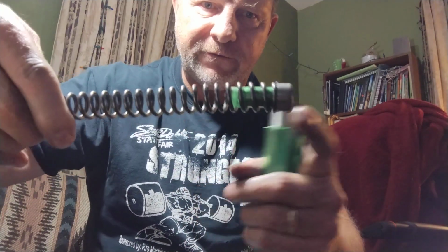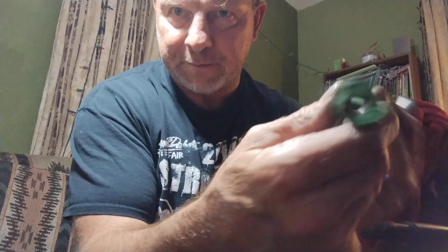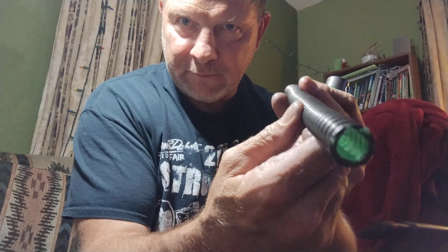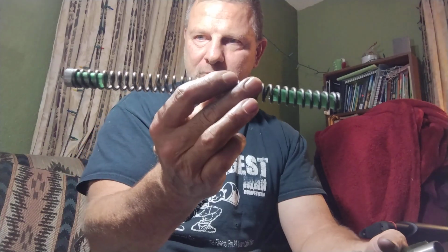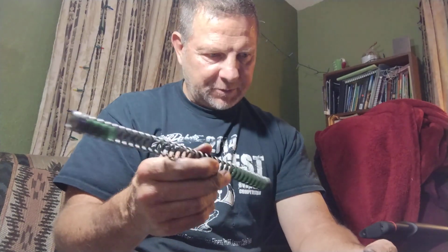You can see that I have made a little piston sleeve for the top hat and for the guide here at the bottom, courtesy of your favorite Mountain Dew beverage. But the spring was getting a little bit bent. It's far from perfect. I don't feel like buying anything new, but I flipped it around, and I also wanted to see if this would possibly give extra life to the spring.